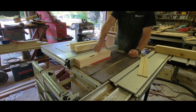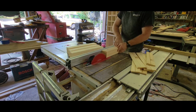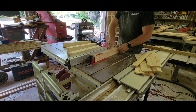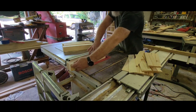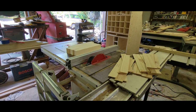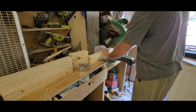Now I'm coming back to the feet — those two-by-four pieces I glued up. I'm ripping them all square into square stock, and you can see they're nice and clean because we jointed those glued faces. Now they just look like really clean blocks of pine. I'm cutting them to final dimensions. These are a little longer because there are actually two legs in each one of these long pieces. I'm taking off a little bit at a time getting them all nice and square, making sure they're exactly the same size — we want all eight of them to be identical. I made a mark on my saw, put a stop block there, and now I can cut all of them to the exact same length.